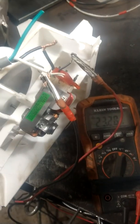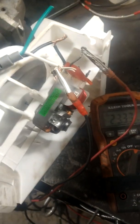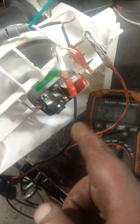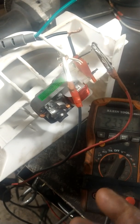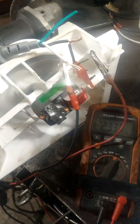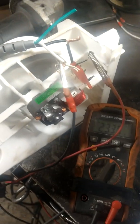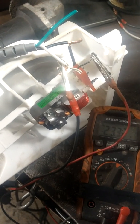I don't know how efficient they are, and I don't know how efficient this one is, or if it would work without the rotating assembly as just a transformer without heating up. But I imagine you could. And if you wanted a different voltage, you could just wrap your conductor around this magnet wire here and measure your voltage as you wrap. The more winds you add, obviously the higher or lower your voltage goes with your turns ratio. That's pretty cool — I couldn't find anything on it on YouTube, so you learn something new every day.